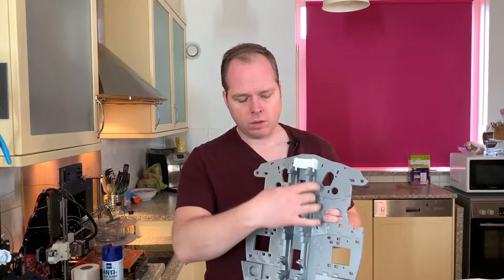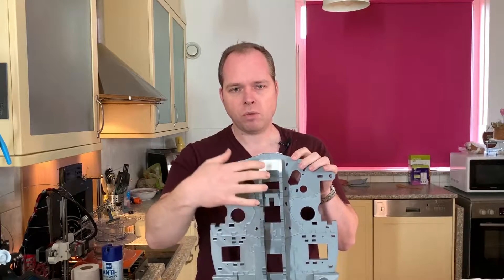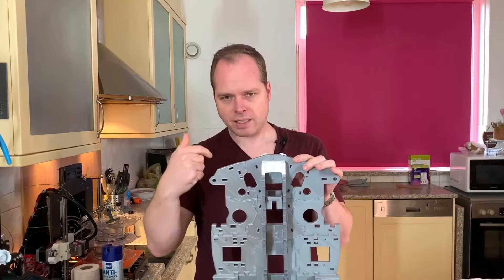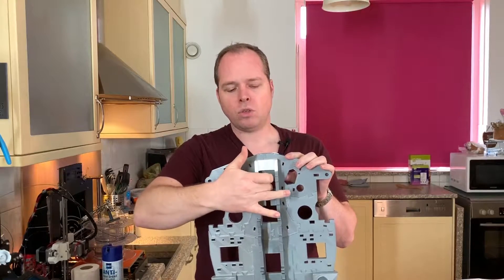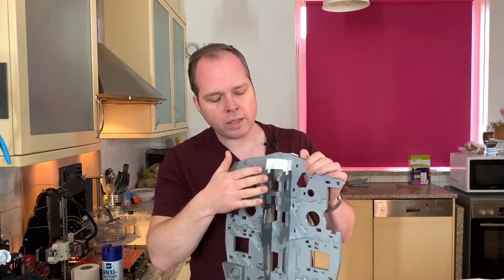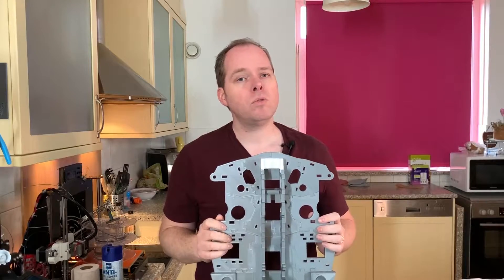For this piece, make sure that when you are going to mount this part, the servo holder is also attached to it before tapping it down with a rubber hammer. Also make sure that the longer side is on the back side, so that your servo is going to sit here with the rotation part and that the part for the piston is here and not on the back side, or else it would look very weird and also get stuck. Now we are going to make the front side.